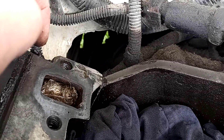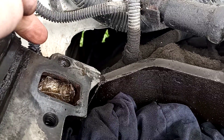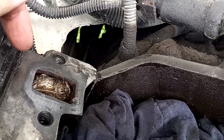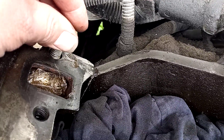That's because somebody has been in here before and I guess stripped the threads out. What I did was I removed that helicoil and I simply just took a tap and re-tapped the threads, cleaned everything up. I didn't drill anything out and now we are good to go.